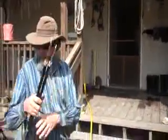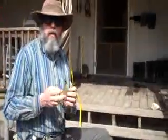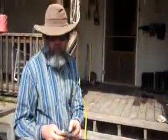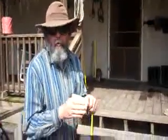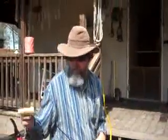So anyhow, something else you're going to need to work on these is waterproof sandpaper. I think you can just get this at Walmart. It's what body shops use. And the whole point of it is, while you're sanding, you're spraying water so the water is cleaning out the area between the grits. With dry sandpaper, you'd have to go through 100 sheets to do anything. This here, one sheet will do a lot of work.